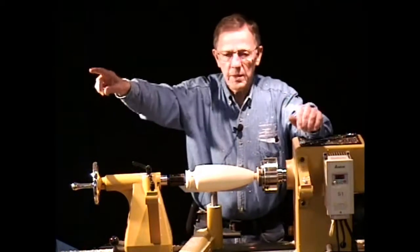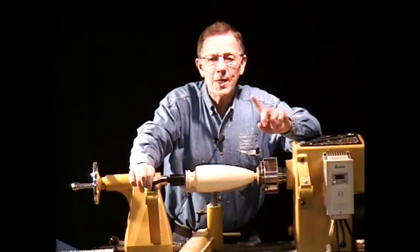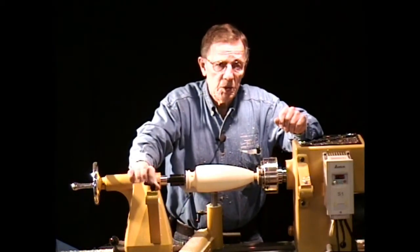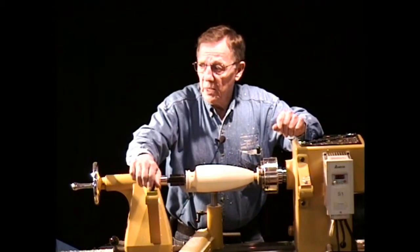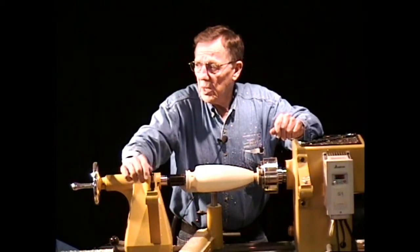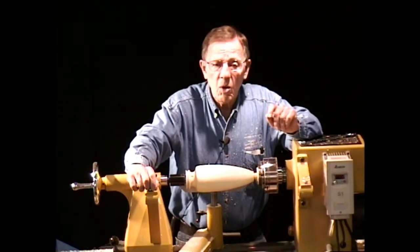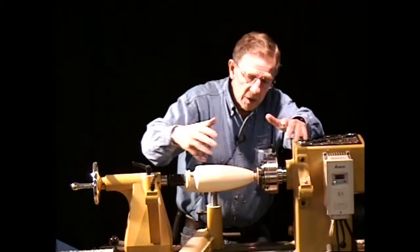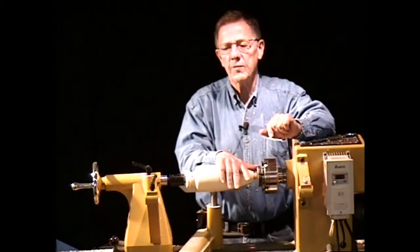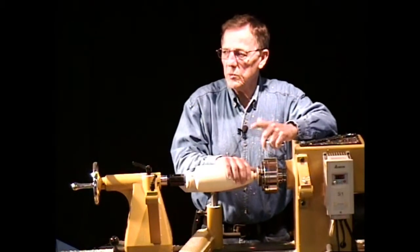Back to the varnish for a second. If you're going to use that varnish, you need to put one coat on top of another. You have to sand between coats. Don't follow the directions on the can that say sand it at 220 grit. Don't do that, because you will see those 220 grit scratches all over that vessel as if they were irrigation canals. So you want to use 600 grit, and the important thing is to get all of the gloss off. Check it several different ways in the light, catch the reflections, and anywhere you have any gloss left on it, the next coat of varnish will not stick. But I learned that's one of the things.